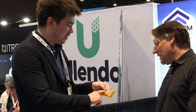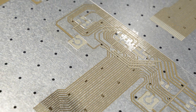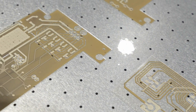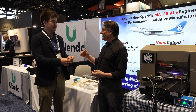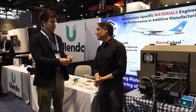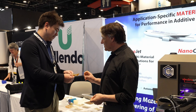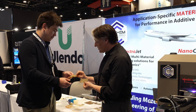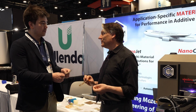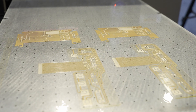Our flagship material is a particle-free silver ink. They're extremely conductive — a normal silver particle ink would have a bunch of fillers in it, and you'd have to have maybe about 30 layers of silver to equal two or three layers of ours. It's nearly the same conductivity as pure silver. We sinter very quickly, so we can go not only on a Kapton substrate but also on PET, which is very low temperature and will deform at low temperatures — we can actually print on these cheaper, low-temperature substrates.